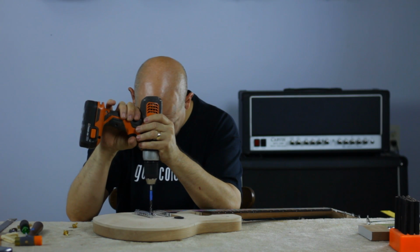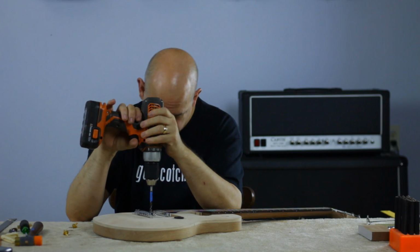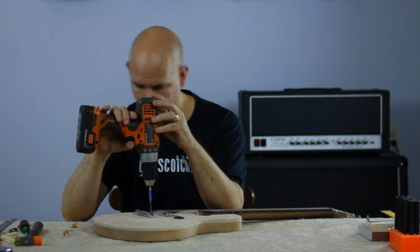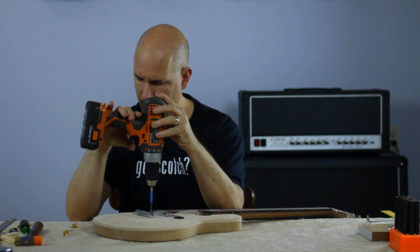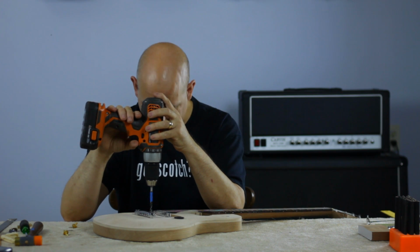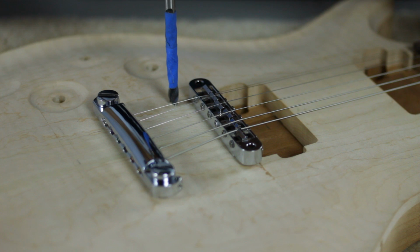When I do this, I'm careful. I get the brad point right down in my marked hole, and I check as best I can for vertical. I brace myself on the table with both elbows and I'm operating the drill with my thumb. I've set the depth on this bit and marked it with some tape, so I'm going to go ahead and drill.